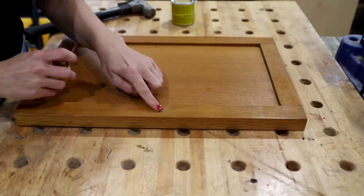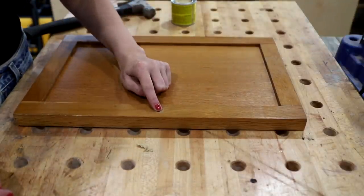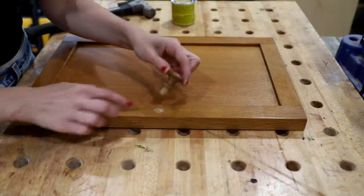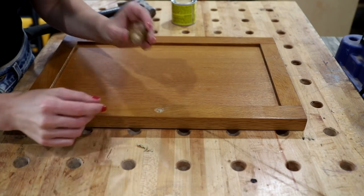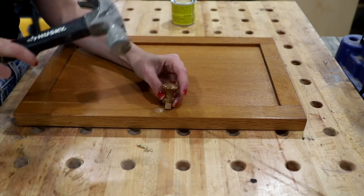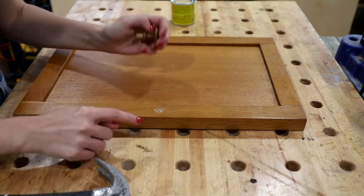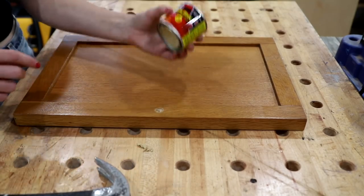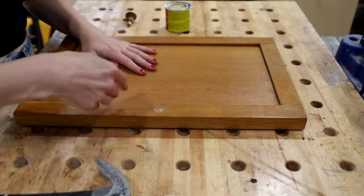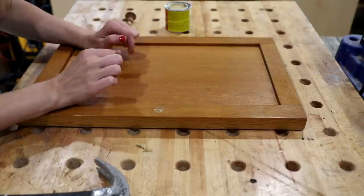I didn't press record — I was completely on autopilot when I did this on both doors. Basically both doors had knobs attached with dowels. I took a hammer and knocked them out pretty aggressively. Now that these are out I'm gonna fill the holes with some wood putty, let it dry, sand it down, and I have new hardware for these so it's gonna look dope.